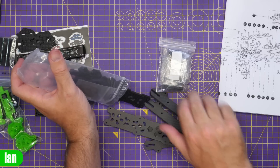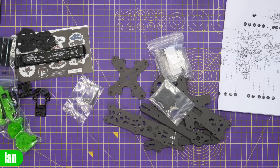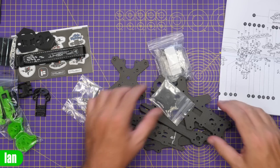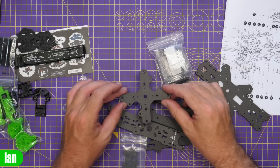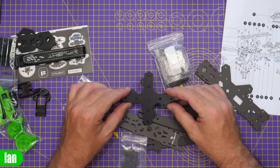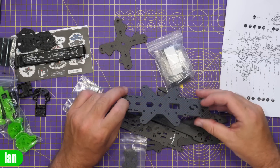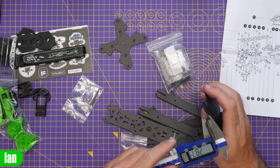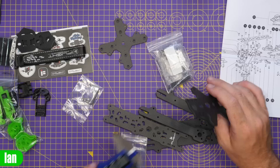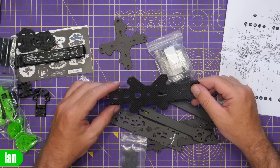Let's get the carbon out and have a look before we do the assembly - I'm going to grab my vernier caliper to check how thick the arms are. We've got an x-plate which has eight nuts pressed into it already as captive nuts. Then we've got our bottom frame part - that is 2.93mm carbon on the base plate, which is nice and solid. The cutting looks really, really good on that - absolutely fantastic.